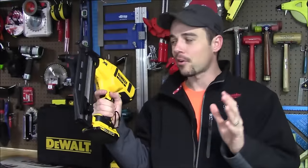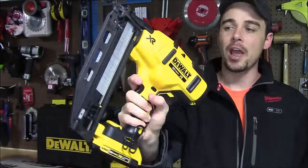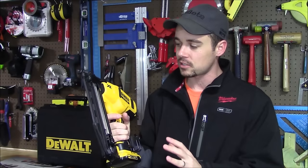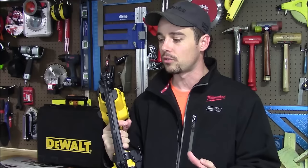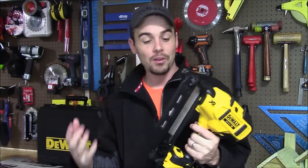Hey everybody, today I'm going to review DEWALT's brand new DCN660 16 gauge angled finish nailer. Now this is a brand new tool in DEWALT's 20 volt max lineup, and it does feature a brushless motor and some really nice design features that make it very easy to use. Pretty much everything on it is going to be tool free, so you can adjust the depth, clear jams, or even clear a stuck piston, and that really makes it easy to use, especially if you don't have other tools